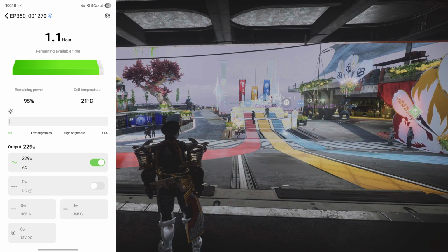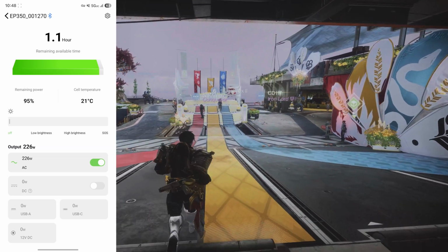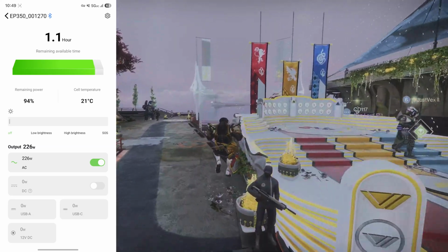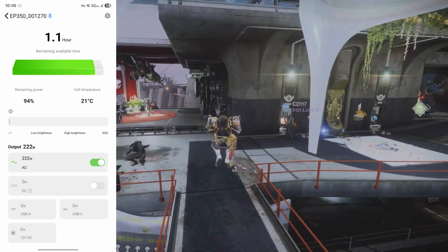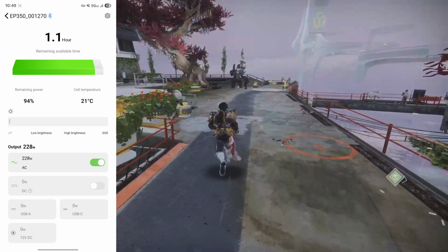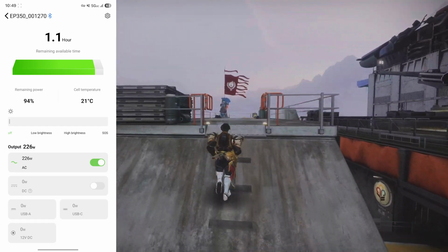It's probably gonna be better than the one built into the console, but so yeah, we're drawing 230 watts, and for 1 hour, we can do this. Now, if the power was out, the TV would be the issue. We would need another power unit for the TV because the console and the TV together would be over 400 watts. And this is a small unit. It doesn't have a large battery. The moment you try to draw that much power, it's not going to last nearly as long.